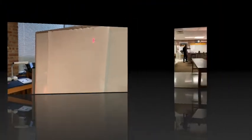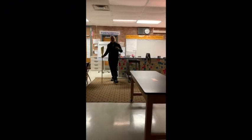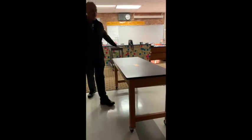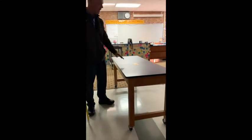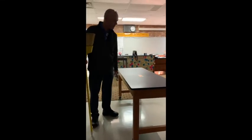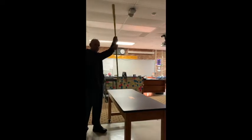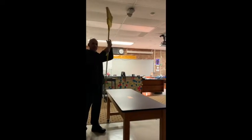We're going to do that for the table too. The further away it is and the shallower the angle of the light against the mirror, the more deflection you'll see. I have the mirror here taped down to the surface of the table and the laser dot is reflecting onto this piece of paper. I'm going to drop something relatively heavy on the table and give it a strike so we can see evidence of vibration up close on the dot.